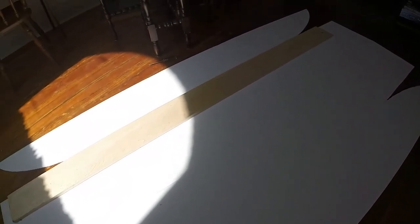This board you're seeing I'm using as a straight edge for both my scoring and bending. I had already stepped on it and bent it up, but I just wanted to show you what it's there for. This stuff is a lot harder to bend straight than you might think — it does want to go with the lines but doesn't always want to stay with them, so the corrugations aren't necessarily the perfect bend. Anyway, I run it down there with the Phillips head screwdriver just to press in that entire length of the bend, and then come back and bend it up next to the board. I'm going to fold these in and try to crease them a bit.